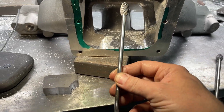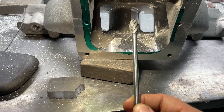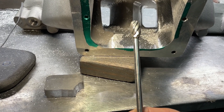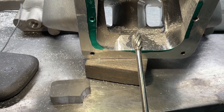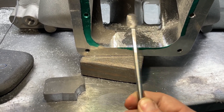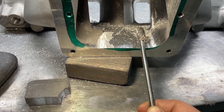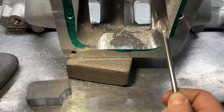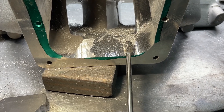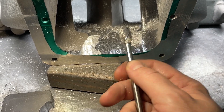The disadvantage is that on some die grinders, they spin so fast that because there's weight out here, it kind of wobbles and creates a vibration. You can turn down the speed or find its magic spot, because every grinder has a magic spot where it's really efficient and grinds fine. If you get outside of that, it might wobble. Beginners find it starts bouncing off because it's not balanced. A shorter shank can't wobble as much, so it feels like you can grind better.